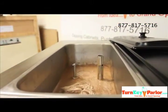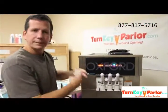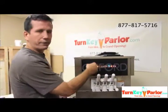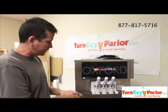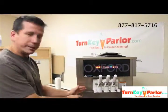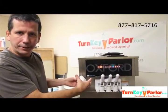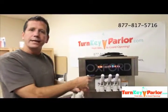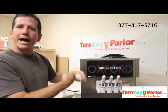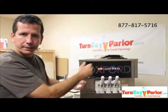Now if the product's not running a cycle — if the machine isn't running a cycle, which it's doing right now — you can hit auto or manual and get the cycle going. Basically what you've done is you haven't allowed any more mix to go into the cylinder. You've drawn some product, essentially creating air inside the cylinder, and now we're running the cycle to freeze the mix that's in the cylinder with that new air that we've created, so that we get a fluffier, better product coming out.